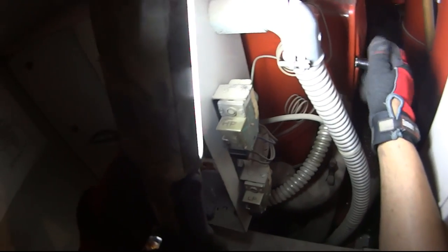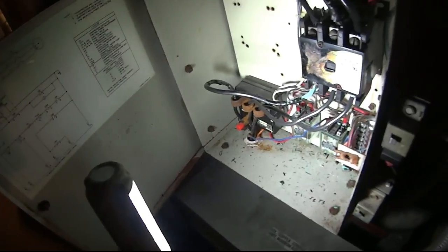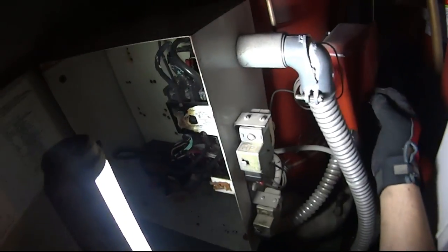There's a little play for the compressor wires, but there's no play for the line voltage coming in. It's a tight fit — boom, right there. It's number six. Let's go ahead and take this one off. This one's cooked bad, real bad. I'm pretty sure that these overloads are bad.